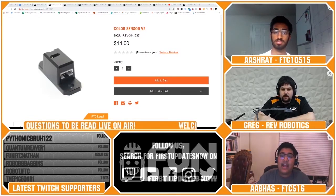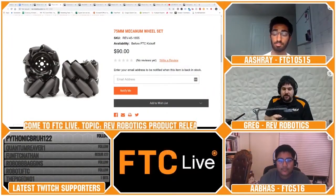12897 Nate Less asks: when designing the mecanum wheel, was there any concern about the added weight of a steel frame? There is a concern, but the reason REV products are generally cost-efficient is the manufacturing method. You can do things with stamped steel and forming that you just can't do with aluminum — you cannot do deep draws out of aluminum. The manufacturing ability and ability to provide these at low cost to teams kind of outweighed the weight concern. Because it is a smaller wheel, you're not heavier than the four-inch options. This is one of the lowest cost mecanum wheels available, and definitely the lowest cost with bearings.